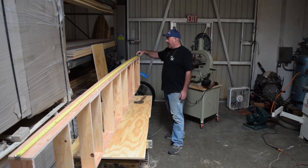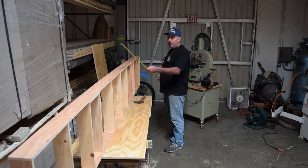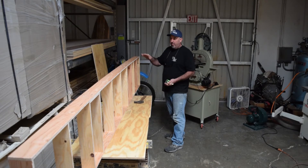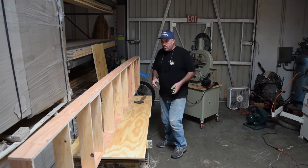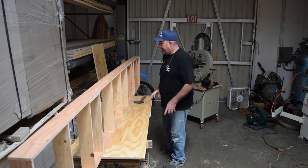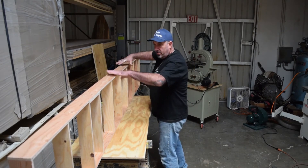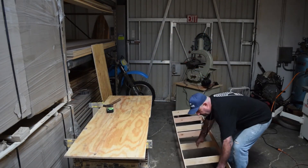This workbench is going to be about a foot longer than the board, but you could build a board longer than the workbench if you let the nose and tail hang over a little bit — you can do that. So my workbench is going to be a little oversized, which is great. Next, I'm going to take these pieces of plywood and nail them on top. Nailing up here is a little bouncy, so I'm just going to put this on the ground and nail it on like that.